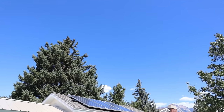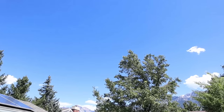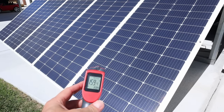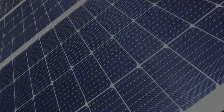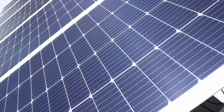To show you the solar conditions today — it's late summer, around 93 degrees, just a little bit of haze and not many clouds at all. Keep in mind these panels are a bit warm today. Using my infrared thermometer, we can see it's right around 159 degrees Fahrenheit. In a lab, these will perform best around 25°C or 77 degrees, so we're going to lose a little bit of power because these panels are warm.